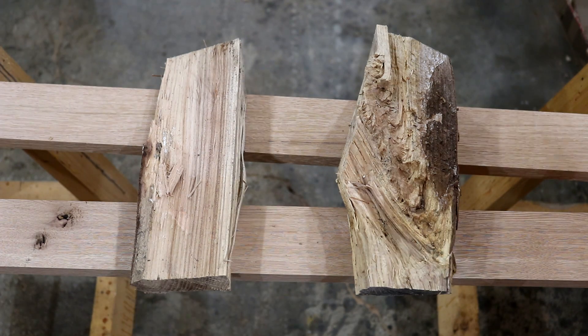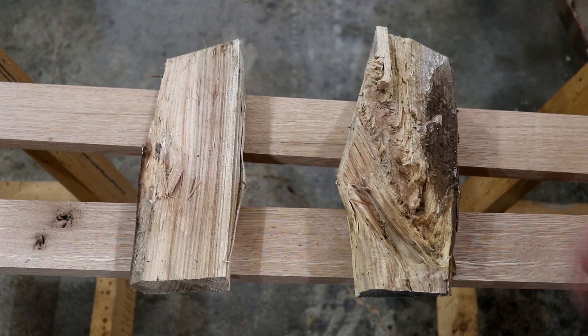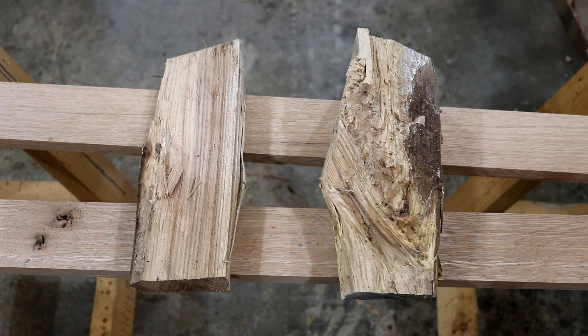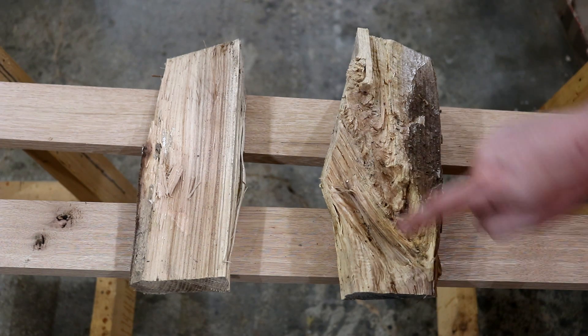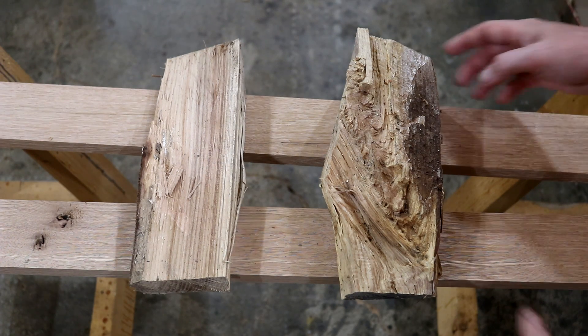What are we looking at here? Well, we have two pieces of firewood. On the left, we have a straight-grained piece of hickory. On the right, we have a gnarly piece of hickory. Why is this important? There is stress involved in all wood. The less stress we have, the more straight-grained, and therefore the less inclination for wood to warp. This piece here was cut out of a crotch end of a log, and as you can see, when the wood decided to split, it did all kinds of crazy things.